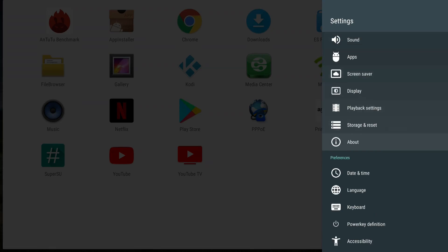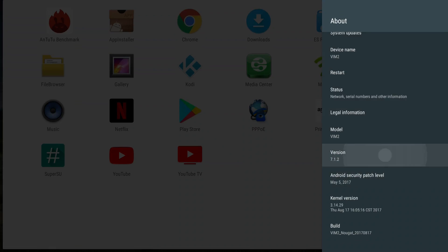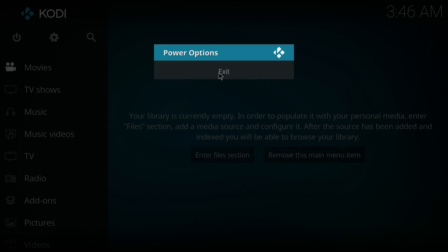Now this 40-pin GPIO is completely different from Raspberry Pi — it's a completely different layout, so if you're going to do a project with the GPIO make sure you follow their pinout. It comes shipped with Android Nougat, which is 7.0, and it works really well. Not only that, it includes root access and the Google Play Store, meaning you can install everything right off the bat without having to figure out how to get Google services on there. I was able to play anything I wanted — basically Netflix, YouTube TV, Kodi — works perfectly fine, and it's fast.